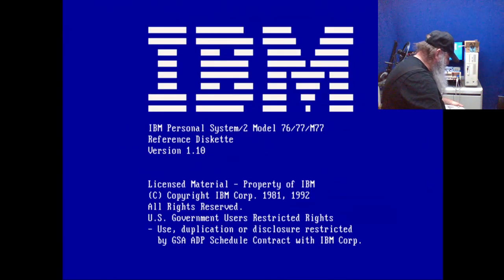The 301 error - I believe that's the keyboard error, not a mouse error. And that's why my keyboard doesn't work: I had the wrong thing plugged in - I had the mouse actually plugged into the keyboard port. Okay, so we only got the 161 and 162 now. The 301 was a keyboard error, not a mouse error, kind of associated in that way.